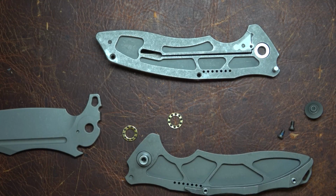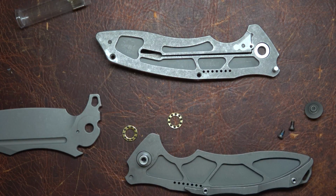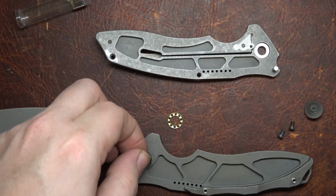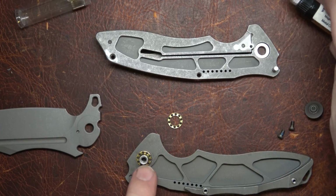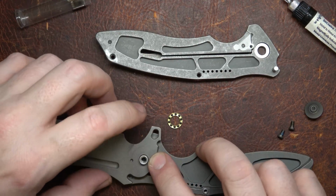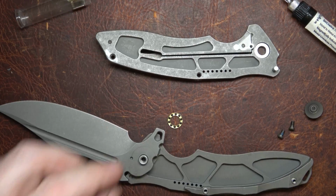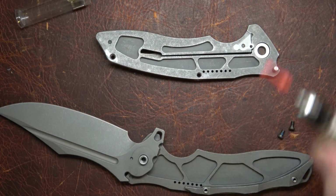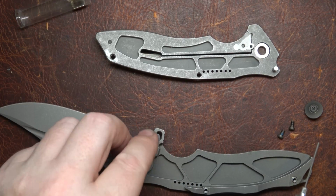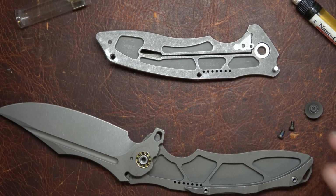Now, get our lighter nano oil. I use some 10 weight. And since we don't have a counterbore on the blade, we're going to put the open side of the bearing race down into the race here. And yeah, I know I goof that up sometimes. In the big scheme of things, it doesn't make that huge a difference in the action of the knife. Where it does make a difference is in how quick it collects crap. It's going to collect a lot of crap if you leave that open side out of the counterbore. That's just the way things are.